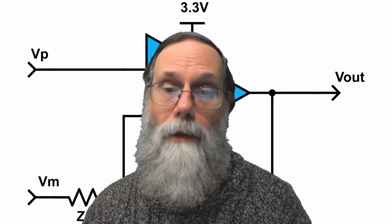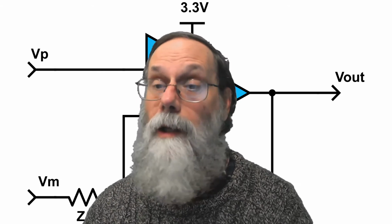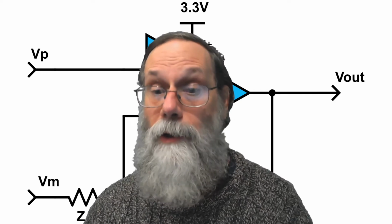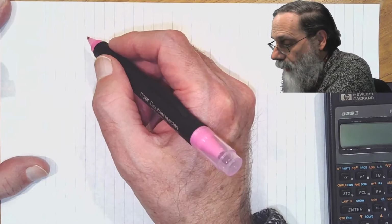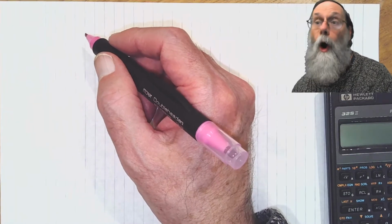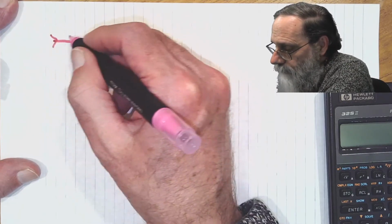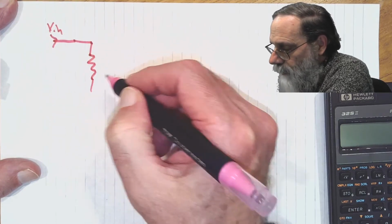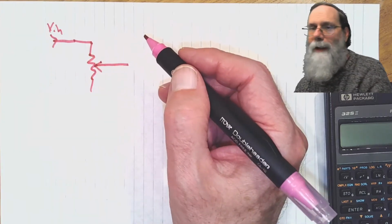And the way we do that in an amplifier varies a lot depending on the type of amplifier, and there's lots of different ways to do it. The simplest thing is just to use a voltage divider. Okay, so if we've got something we want to adjust from all the way off, so that's a gain of 0, up to some maximum gain, we can take the input and stick it into a resistor, and now we can put a potentiometer here as the resistor.